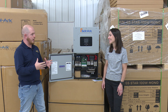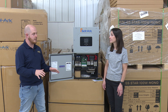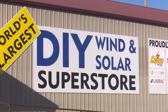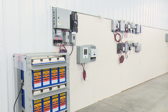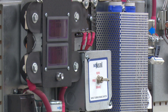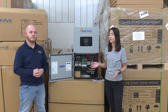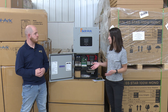Right now we're talking about batteries, because a lot of places might tell people you can't have batteries — it's too complicated — but that's not necessarily true. A lot of people when they're first starting to get into solar go with a grid-tie system, where solar comes into your home and feeds into your power system, maybe flowing back into the grid if you produce enough. The idea is that a grid-tie inverter installed on your home can't handle batteries, and if the power goes out from the electric company, your solar goes out too.